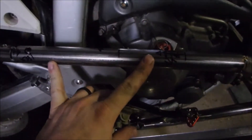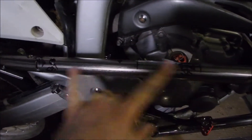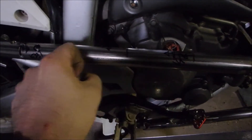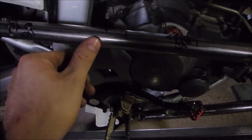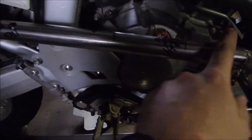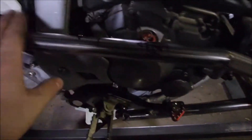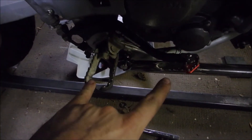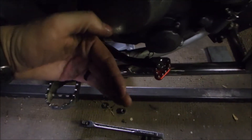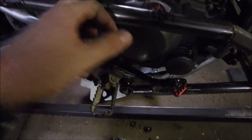As you can see, I've got some markings up here. There's a dead zone from here to here where my leg needs to be, so I don't weld anything there. One issue I'm having is my leg hits this a little bit. Rather than trying to cut it and offset it repeatedly and then figure out a way to put oil in it, I'm just going to leave it like this and either deal with the controls as they are, or possibly extend this foot peg out, put the factory lever back on and bend it out a little bit. But I'll probably just leave it just like this because I can still operate the brake just fine — it's just my leg's up against it.